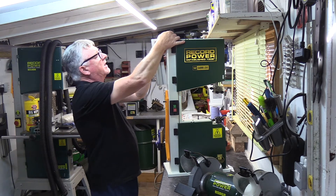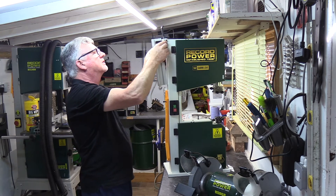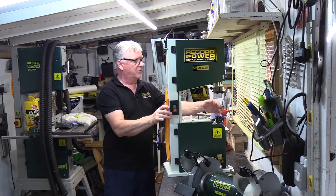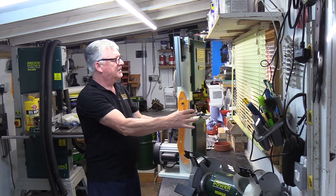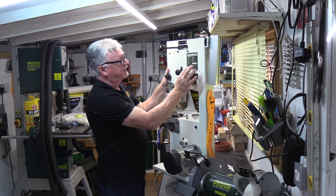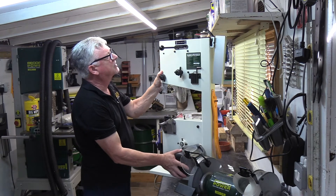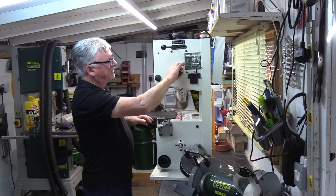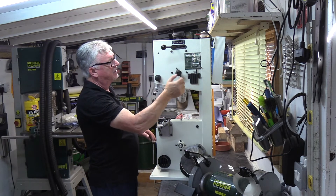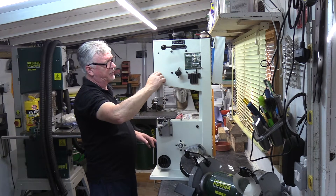I've also put in situ the screw for the push stick. On the top here we've got a little bracket fitted so you can keep your fence in place — the fence slides on there and then just clamps it fixed. On the back you've got a little location for your keys and spanner. Then there's the standard items: the tracking knob, which you lock there for adjusting the angle of the bandwheel, and then this takes your tool arm up and down.